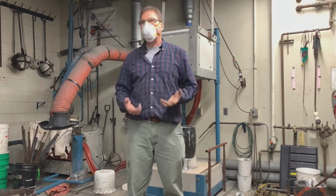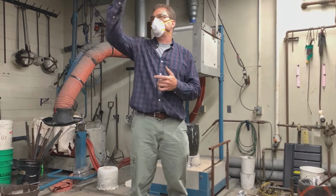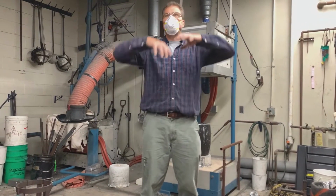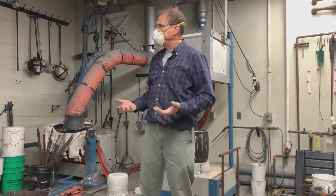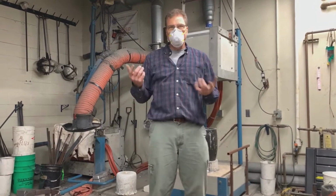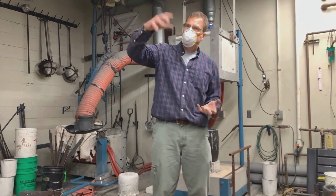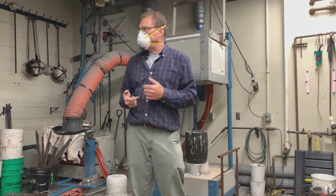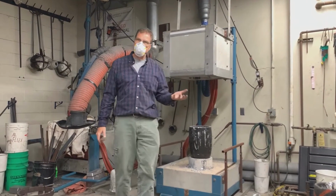So it's good and bad. Stirring can also bring the metal up in contact with the surface. So if there's stuff in the air that's bad, or if it's oxidizing, that's bad, right? But the good thing about it is if you put some alloying elements in there, they will dissolve and get mixed in really well. Okay, so induction is one of the ways to heat.